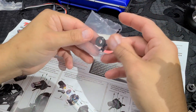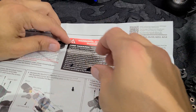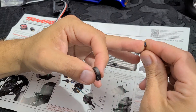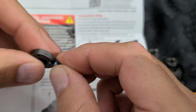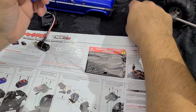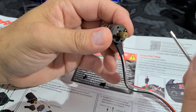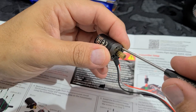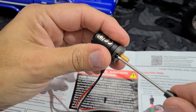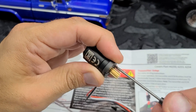On the inside of this motor adapter we have a couple of screws — two screws will hold the motor to the mounting plate and the other two will affix it to the transmission. These screws come set up already with blue Loctite. We'll set those in place and mount the motor. Got to do this real carefully because these screws are very small and delicate, so I'll do that by hand. We've got the motor plate in place — just push it in, get that one started, place the other screw in, and tighten them down together. This does not require a whole lot of pressure.